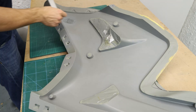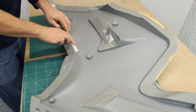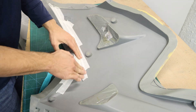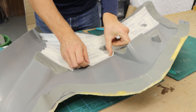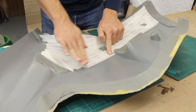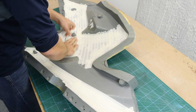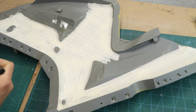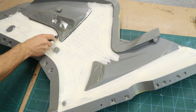After the release agent dried up, I masked the whole mold with masking tape, doing it in sections. This way the tape is easier to remove and I don't have to handle it in such big pieces. The sections of the tape templates will give me the size of the prepreg. With a sharpie I marked the split lines and the edges.